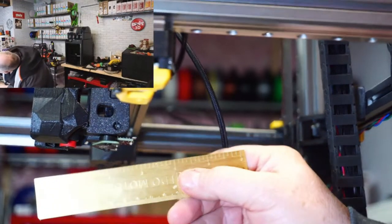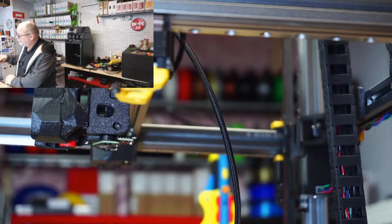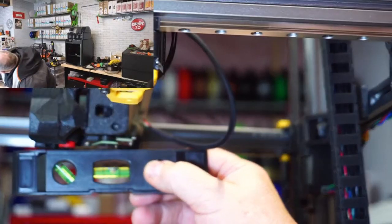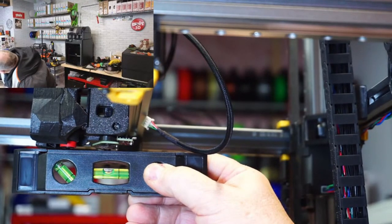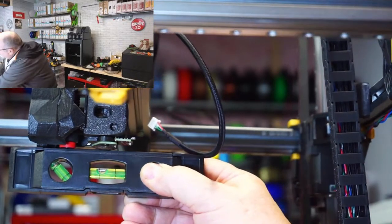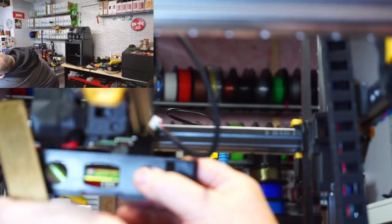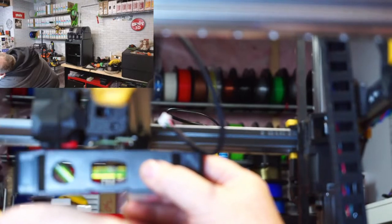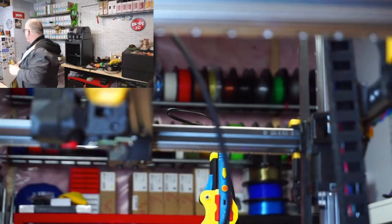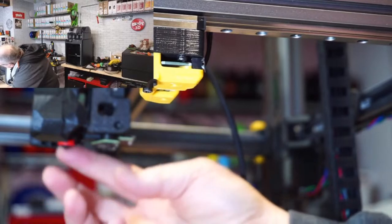So if I take this ruler and I touch the nozzle, actually, better than the ruler, if I take my little level, touch the tip of the nozzle and make it level. Yeah, oh gosh, that's almost the exact amount that they're going to recommend. It's level right about there. And now if I do a rough estimate with my ruler, might even be a little much. That's about 5, get level. Oh, we're looking at about 4 millimeters, so it's not bad. And if I have to lower it to 3, I think they say the maximum is a 3 millimeter difference in height. There's lots of room to lower this because I've got it up at its maximum height, but I think I'm good right where I am. So I think that's going to be good right there.